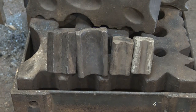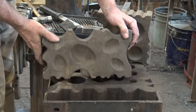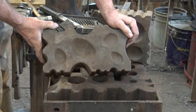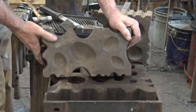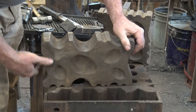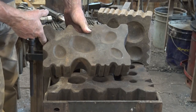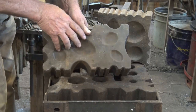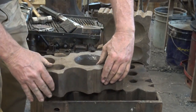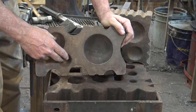But people have come up with a much better idea for a swedge block, and that is these nice cast swedge blocks. And these come in various sizes and configurations. Some are available today, some are not. This particular one has 4 sides with different depressions. Most are half rounds because that's the most common, but this one does have a V-swedge in one end. And on the flats it has 4 different size spoon depressions. And on the other side it has 3 different ladles or bowls.